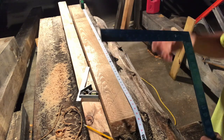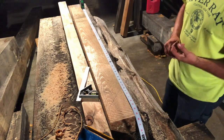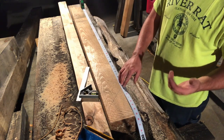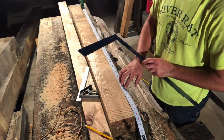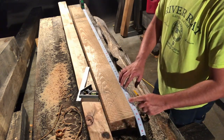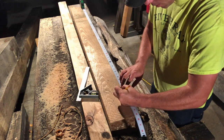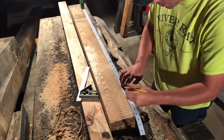So 50.91 inches is going to be the total length of that brace at a 45-degree angle. So you multiply 16 times 0.91, and that's going to get you 14.56, which you can round up to 15/16. So that number, 50.91, for a 3-foot by 3-foot layout, is the total brace length. That does not include the tenon, that's just to hit my 3-by-3 layout. Total brace length is going to be 50.91 inches, or 50 15/16.